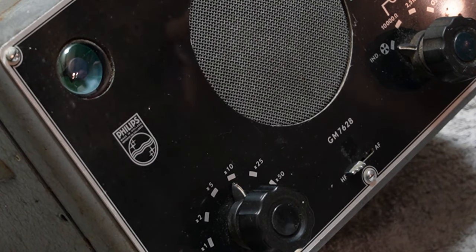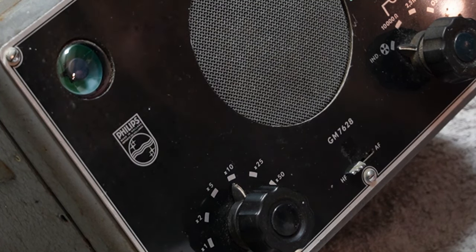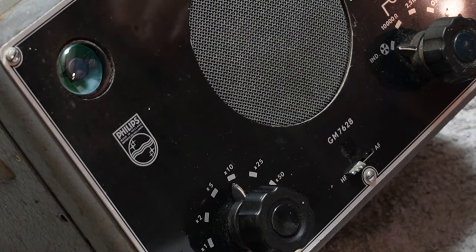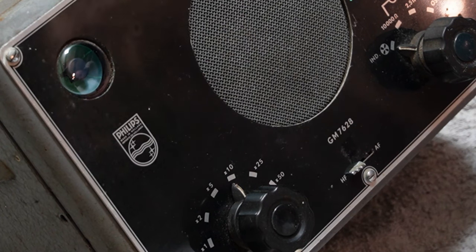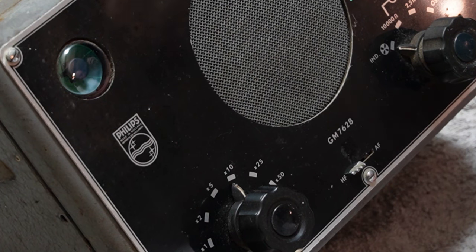Yeah, this is done. The Atwater Kent, I need to get onto that, so hopefully you'll see another part to that. I made a decision on that one, if you recall, and you probably don't. I barely recall. The Atwater Kent was at a point where I discovered that the RF subchassis was wired with some updates. There were some resistors in there that didn't match the circuit I had. I wasn't sure what I was going to do about that because they're big, long, flexible resistors and they are completely shot. So I have no idea what value they were. My plan there is to take it back to factory spec, back to its original design, which worked just fine. The modifications and changes were made, but I don't know why they were made, and I can't do anything about that because there's no published circuit for those updates that I have been able to find.